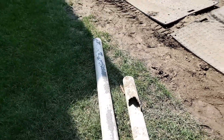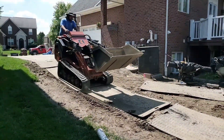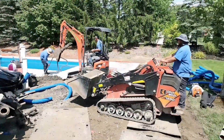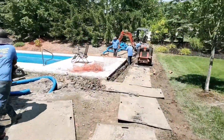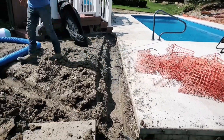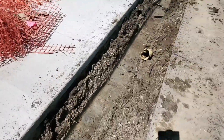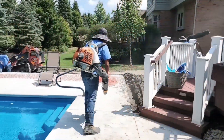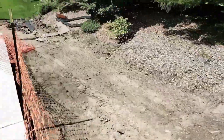The system we replaced was a PVC system — we don't like using PVC, we prefer corrugated pipe because PVC cracks in the north. We have freeze-ups and you can't avoid a freeze-up. You can't build around a freeze-up, you can't build yourself out of freeze-ups. I don't care how much slope you've got or what pipe you use — in the north, ice builds up.